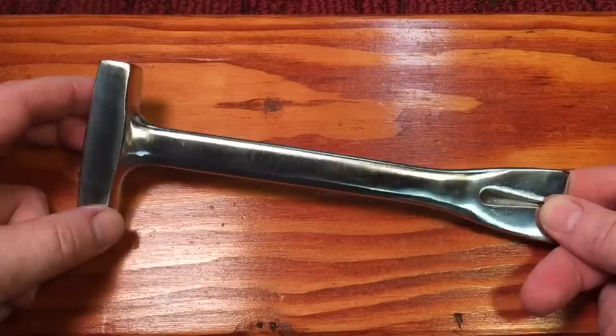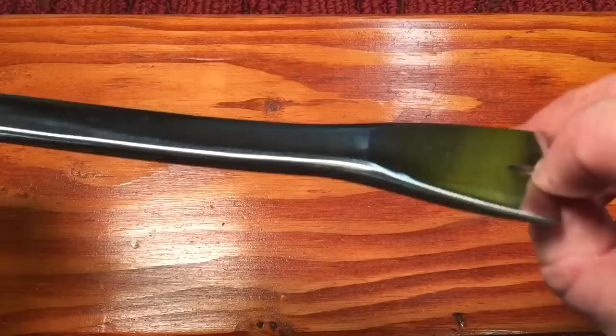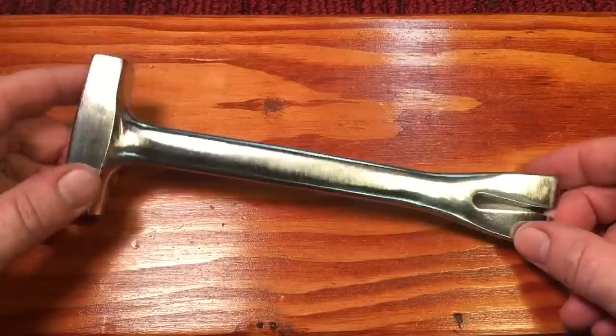One thing I really stress: whenever you take down a little bit of finish on both sides you're going to leave sharp edges, and you have to go over every edge at a 45-degree angle so all the edges are softened. When you feel it, it's buttery smooth in your hand — that's the best part of redoing these tools. So here's that two-dollar — probably a Bridgeport — nail puller restored. Anyway, hope you enjoyed this one. Thanks very much, another Monday in the can. Hope you have a good week, take care, bye-bye.